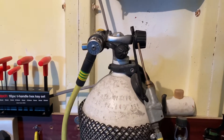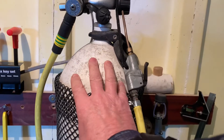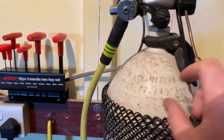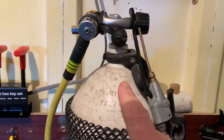This will last a long time. It is £4 to fill at the local dive shop. It takes 3,500 PSI in the main tank. And you're saying, well you can't use that — but you can. I've got regulators because I do intend to put a dial gauge in here. It's 3,500 PSI, which is far in excess of what we'd want for any kind of garage work or useful compressor.